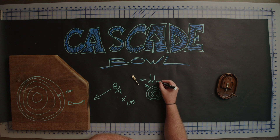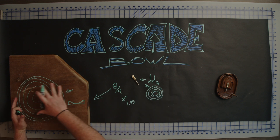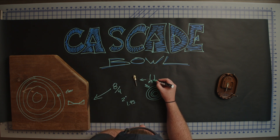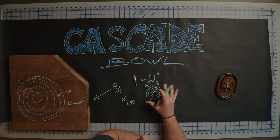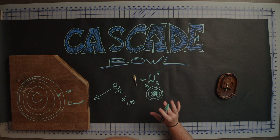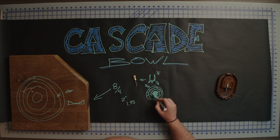This bit does have a flat bottom on it, and that is only an eighth of an inch, which means we have to keep our step-over very tight. For a final pass it's going to look great — you won't have to do a ton of sanding. But for an area where you're trying to hog out as much material as possible, we're creating a roughing pass specifically for this tool, stepping over the full amount of the bit, which is half of an inch. This is going to create a lot of noise, and if you've got a machine that can handle it, it'll work fine, but it won't create a very flat bottom. So for these outside toolpaths we'll do the roughing pass, and then the very last final pass we'll run normally to get a very nice flat and smooth bottom, saving time while still clearing material.